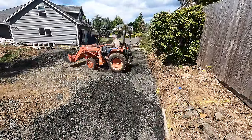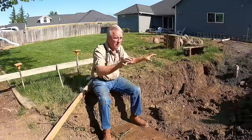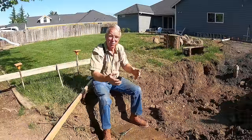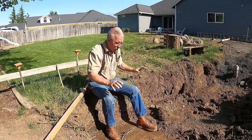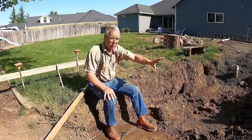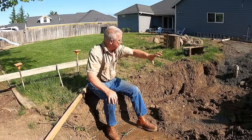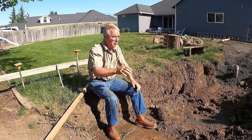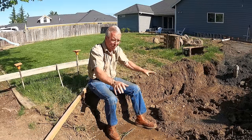You've heard me talk about expansive soils and structural fill. As I'm finishing up the last corner where I need to do some over-excavation on the corner of Ben and Amanda's shop, I've got a chance to show you what I'm talking about. I'm sitting on about a 24-inch cut right here. I went down 24 inches because the corner of the building got off of the RV parking pad, which has a nice subgrade — one-inch minus compacted on top of six-inch base rock. In the areas where we got off that pad, I over-excavated, put in one-inch minus, and compacted it really hard.